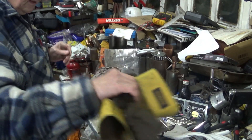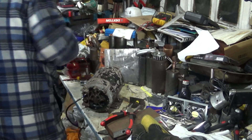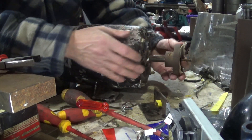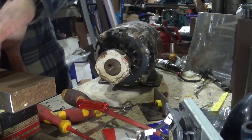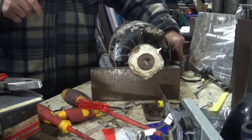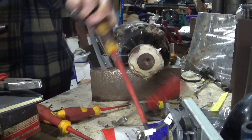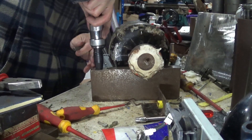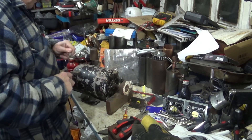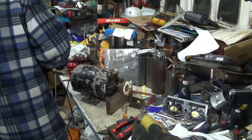So what we're going to do now — it's got a bit of a stuck screw holding this pulley on. I've tried with various different means that have achieved nothing. So what I'm going to use now is an impact driver. You'll see if I take that off and put it on there — as you go down, that moves — and it's actually set to undo. That gives the fastener both a shock, and now let's go to the big boy's hammer.